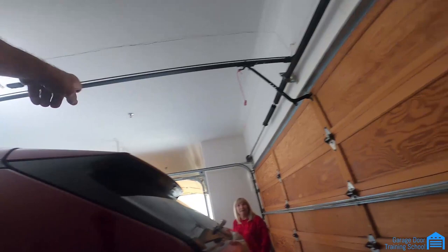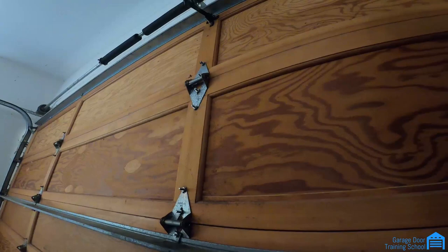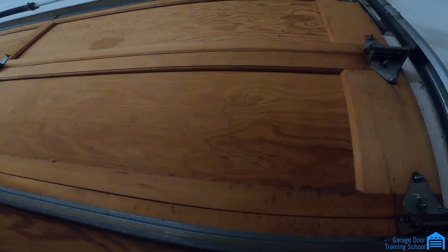The door's too heavy. See, these are wound up. You can't tell them right now, but they're wound up like 30 times. They don't make lighter doors in the future. Yeah, they have the steel doors. They're lighter. I don't want that. And then those springs pull on that shaft. They're tightened into it. And then they pull on these cables, which are tightened into the drums.